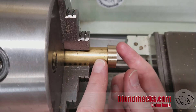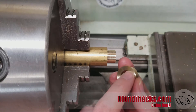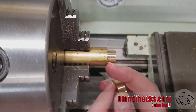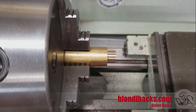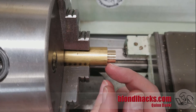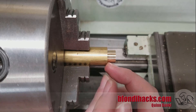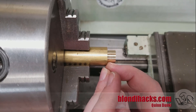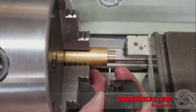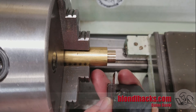If it's critical that these two parts mate tightly together, there are two things we can do. Either we can machine a little chamfer on the inside corner to make clearance for that invisible fillet, or we can go in and get rid of it with an undercut. One way: at that magic moment when the indicator is at zero and you're just about to wind out, push the cross slide in just a couple of thousandths — if you get too aggressive you'll get chatter, but just push it in a little — then do your wind out to face the end of your shoulder. The other way is to use something like a parting tool and just nibble out a hair right in there.